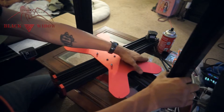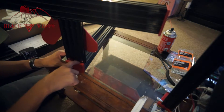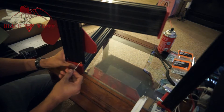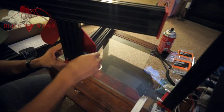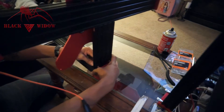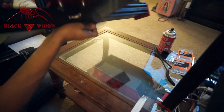I'm going to set these first two screws loose, then take this side out again. We're going to hold this up and set these two bottom screws from the bottom. But notice I have this giant gap here — that's not supposed to be like that. So I'm going to loosen this one again, close that gap, and retighten it. Now when you tighten these two it should be good, getting them nice and flush. We'll tighten that side, and then do the same on the other one. This side did shift on me, so I'm going to loosen it from the back side, close it, and tighten it. Now we're nice and tight — I'll double-check these bottom ones. Perfect.